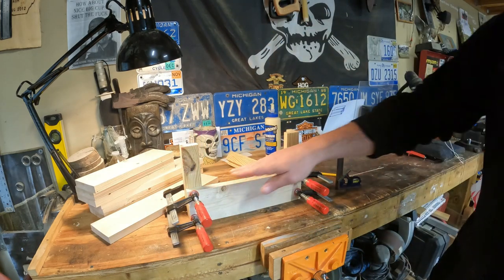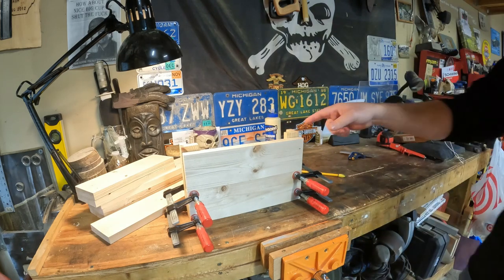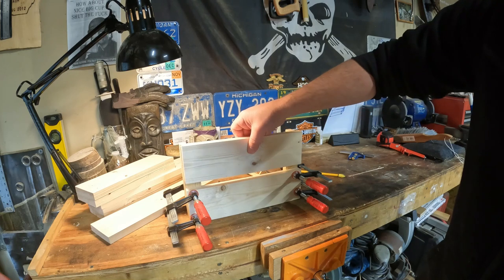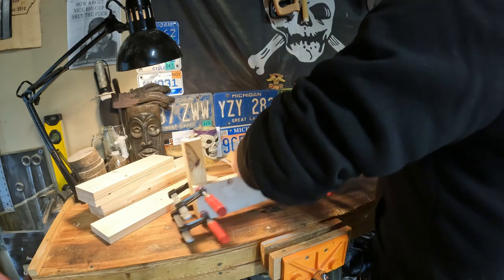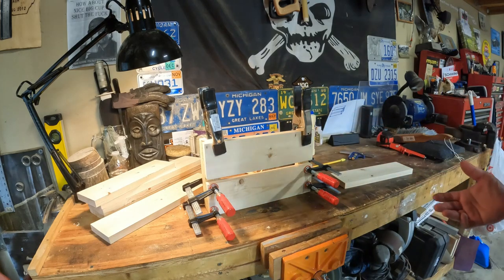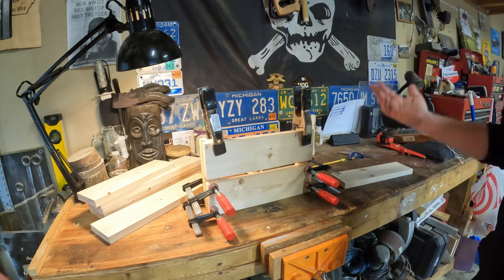I want these edges to be nice and flush and square. I'm going to do the top piece now. I didn't build the box to be completely solid - there's a bit of space here. I designed this to have a half-inch gap between boards, mainly for air circulation if I'm using it for firewood, and also it just looks more like a crate than just a box. If you haven't used TiteBond glue before, this stuff glues stronger than the wood itself - people have tested glued joints and the wood actually failed before the joint. There's a TiteBond 3 that's water resistant if you're using it in a wet application. I'm going to add some type of mechanical fastener - nail or screw - in the end as well.